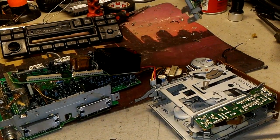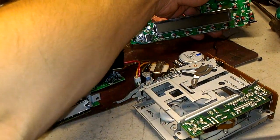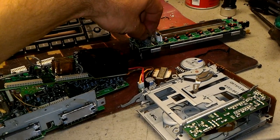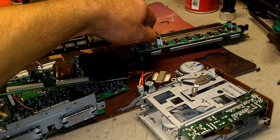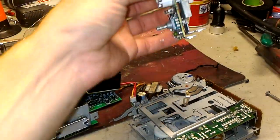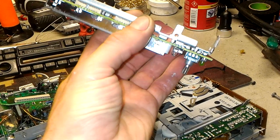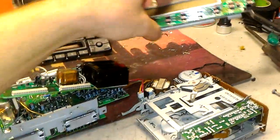And also, I was going to ask you about your volume knob, because the volume knobs always go when you try to turn the volume. It just doesn't. You go down, the volume goes up. You increase, the volume decreases, and you try to have this fine balance, but it's kind of funny because they usually fail. Now, in order to replace this thing, I do have replacement units, but yeah, you take the metal plate off and remove the volume knob, and put a new one in, put the metal back in, and you know, it's a procedure.